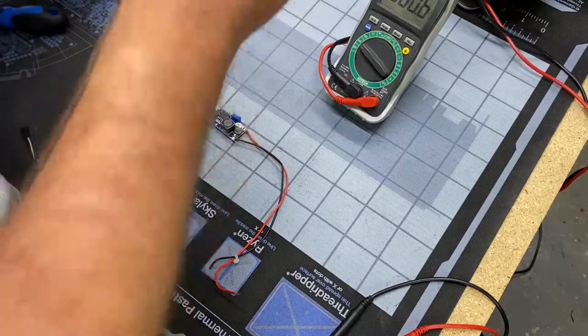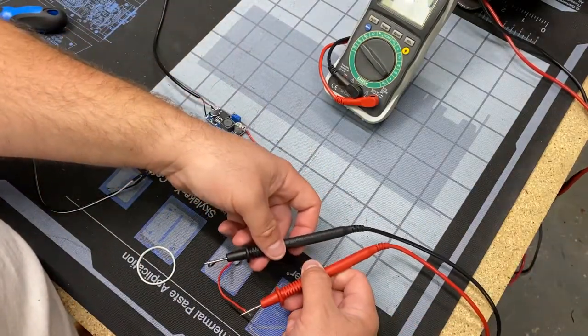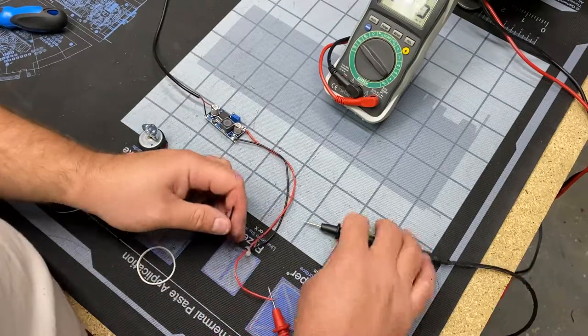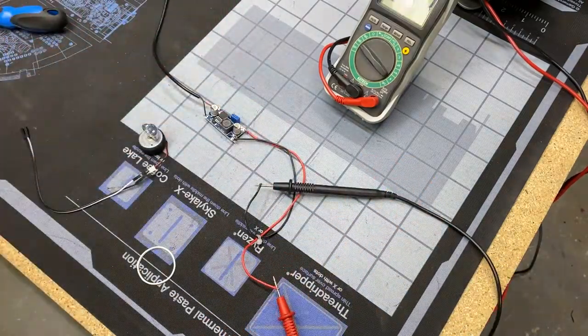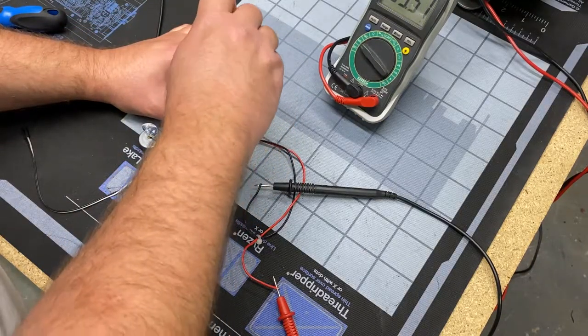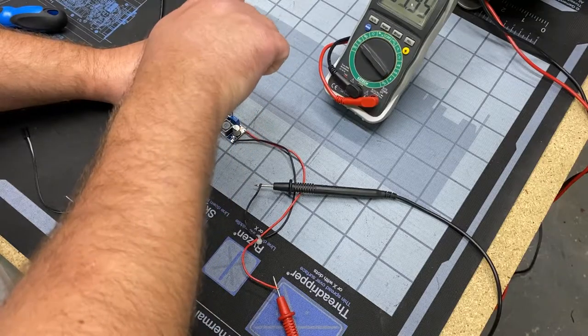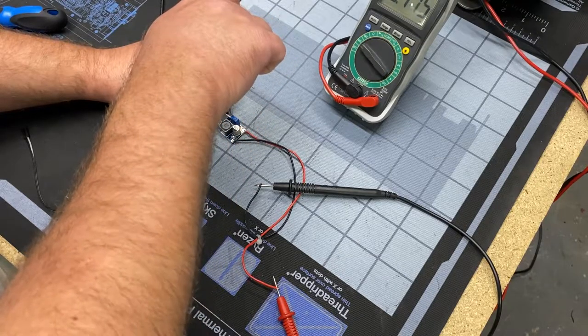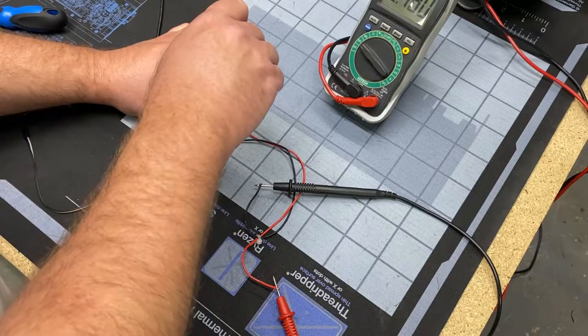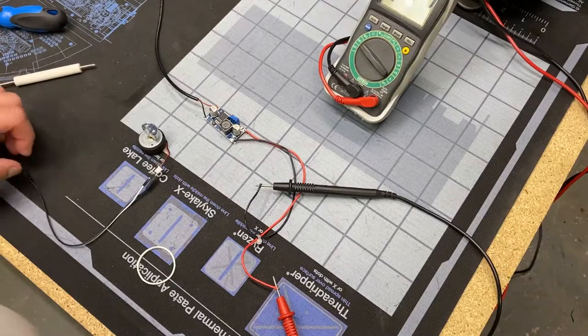Okay, me again. Wanted to explain what I'm doing here, because there's a glare on my multimeter, unfortunately. I tried to get that in frame for you guys. But basically, this is a voltage step-down converter. On the input, the left-hand side, that goes to the wall. There's a converter on it. It's feeding me, I think it was 24 volts, just to simulate being plugged into an arcade power supply. And then on the output side, I need 3.3 volts for the Xbox controller motors.